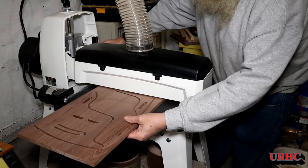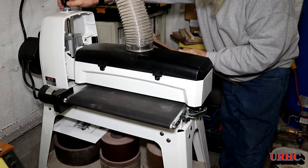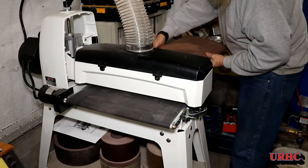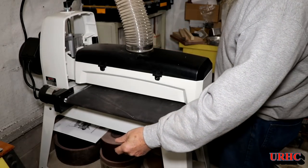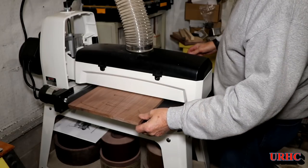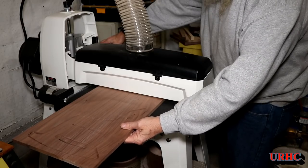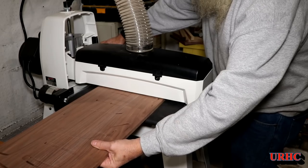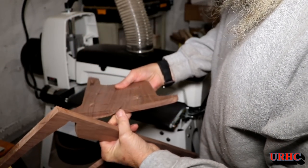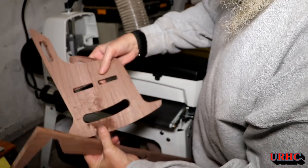Over to the little Jet drum sander — one of the reasons I got it is for making a lot of little parts on the router. I can just run them through. I ran one pass on the first side, flipped it over, and I've got about five thousandths to remove, and the parts will actually just fall right out. I wanted to do that so I wouldn't have any pieces flying if anything let loose. I don't have my tabs worked out because I'm actually using SheetCam from my plasma table to do all the programming. The sander worked good — parts coming right out after a couple thin passes, and all the fuzz on the edges from the bit is cleaned up.